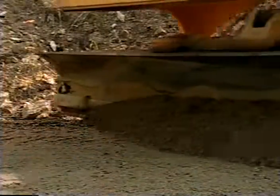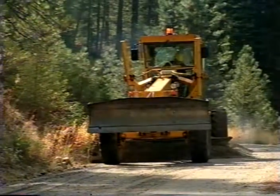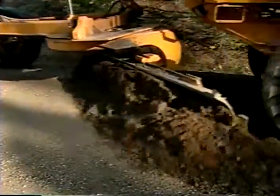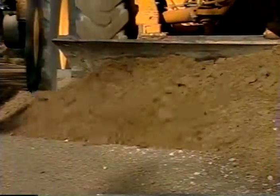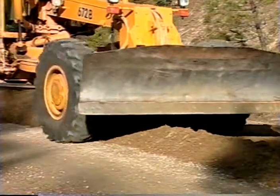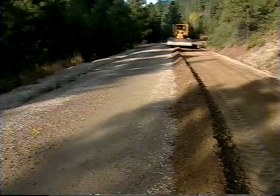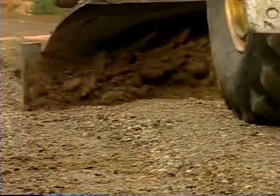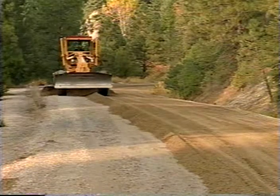Your first pass is a cutting pass, typically starting on the ditch side of the road. Angle the mold board in a position slightly back from vertical to facilitate a cutting action. The horizontal angle should be approximately 30 to 45 degrees from the motor grader's axis. Cut deep enough to remove all surface imperfections and restore the crown template. Move the surfacing material from the ditch side to a point just across the center line of the road. Retrieve any lost surfacing material on the outside road shoulder, blading it toward the center of the roadway to be incorporated with the material being cut from the traveled way.